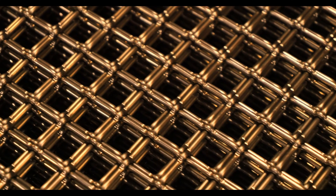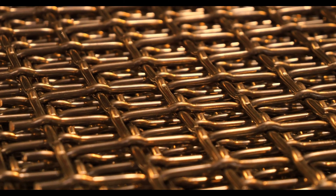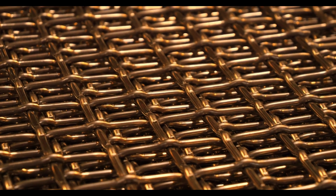Since it doesn't occur naturally, molybdenum is added to 316 in its molten stage, which will bond the molybdenum on a molecular level. The resulting effect is a stabilized stainless steel alloy that has increased resistance to corrosion, further enhanced because of the lack of carbon in the alloy. This makes 316 stainless steel a perfect fit for heavy exposure to moisture, and with it being a low carbon alloy, that makes it much less susceptible to rust.